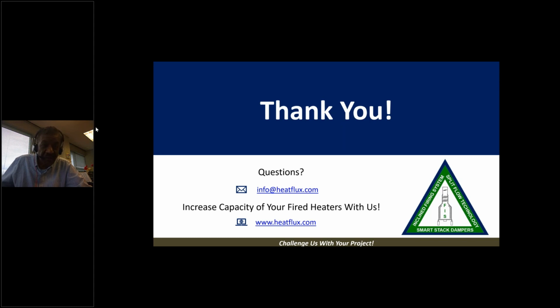Has this been evaluated on delayed coker heaters? If so, how do you handle the skin temperature on the turndown? So we have not looked at delayed cokers. Delayed cokers, as you know, are the critical heaters, and it can be done, but we have not looked at it. I think there are other ways. Do you have a reference in Europe? No, our references are mostly in the US.